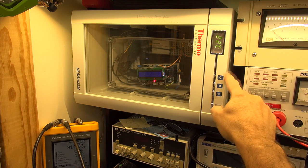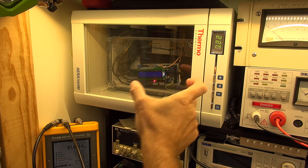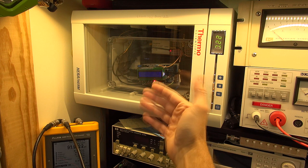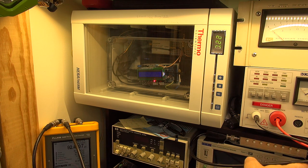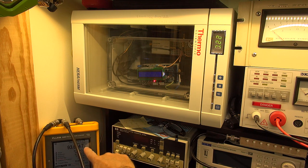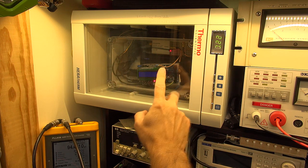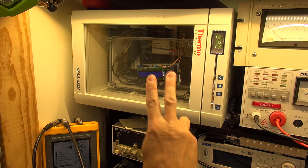I'm measuring down to microseconds and nanoseconds, so I can see what's happening fairly quickly once I make a temperature change. I've got some data on that. I've now set up for another year to see if I can improve the accuracy. I'll also show you the data logging on the Keysight — I've got a Keysight 53220A which does data logging. The Fluke I keep there for easy real-time sanity checks. I can check the difference between an atomic second — I've got a device down here pulling the atomic second from the satellites — and my device sends out a one-second pulse. I'm comparing the time between each of those, hoping to minimize the drift.